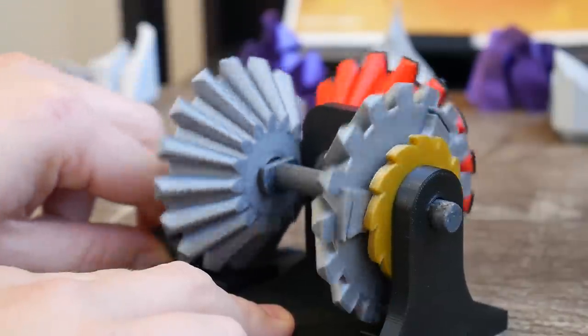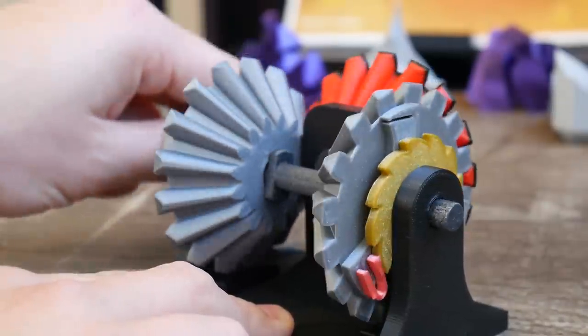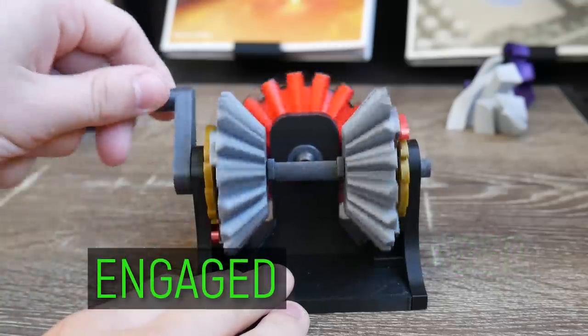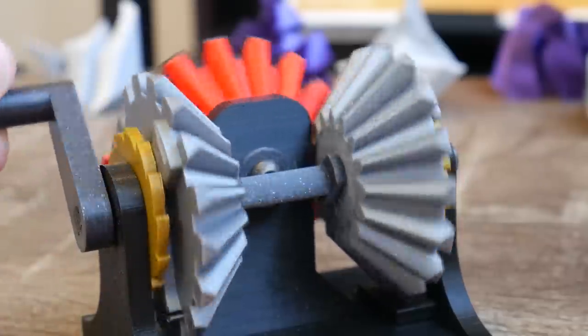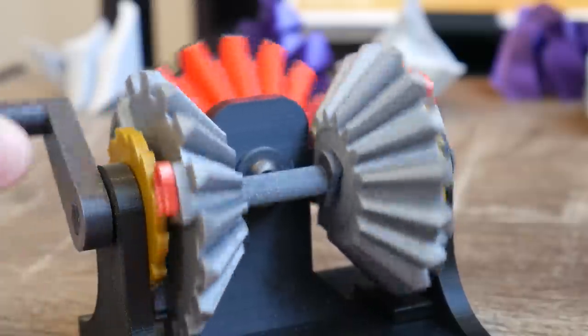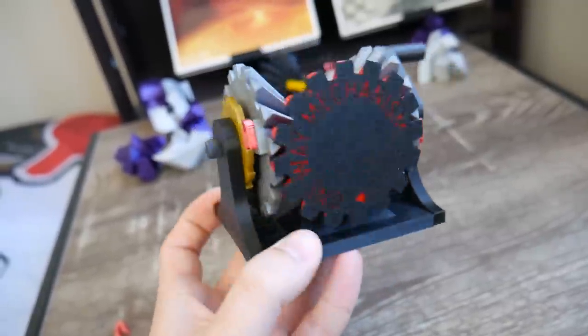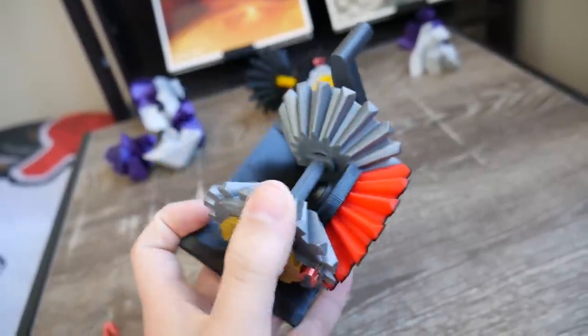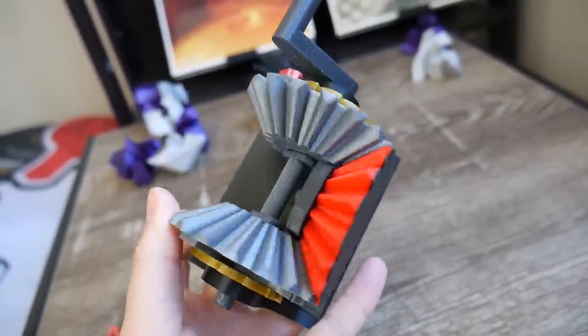When the handle is turned, only one of the bevel gears is engaged, with the other spinning freely — with that all too familiar ratchet clicking. Clockwise, this gear engages. Counterclockwise, this gear. The gears, however, are always meshed, so when not engaged, the non-driven bevel gear rotates against the axle's rotation and around its ratchet. Which is why you get the continuous noise no matter which direction you turn the shaft. There is literally no way the red and black output gear can turn counterclockwise. Ever. It's a very progressive look to the future kind of design.